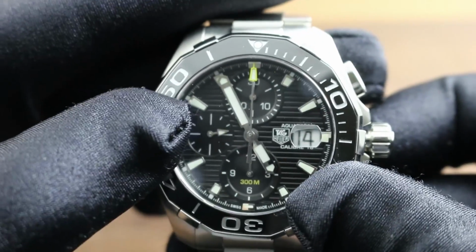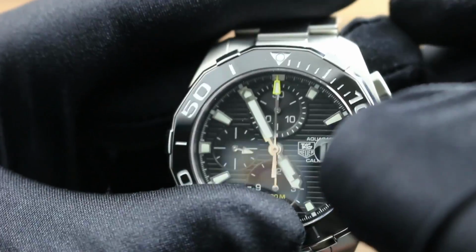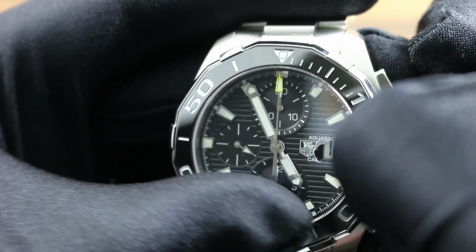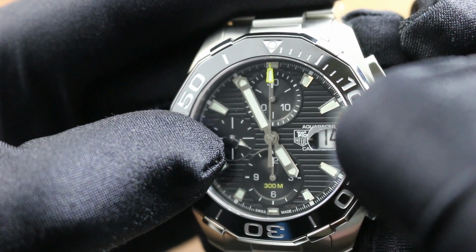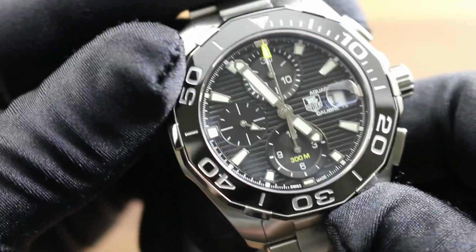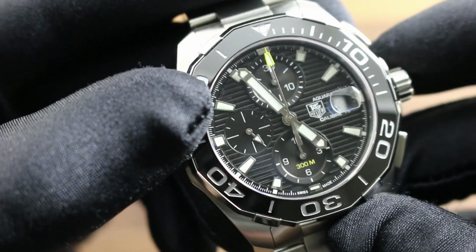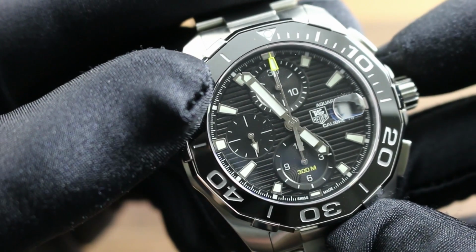It's also important to note, watch the advance of the constant seconds hand at 9 o'clock, that if you pull the crown to extremity, the watch stops beating, allowing precise synchronization to the second against a known accurate reference time, such as an atomic clock. It's important that after usage of any setting or winding functions, the crown be threaded in completely to protect it against physical blows as well as water intrusion.